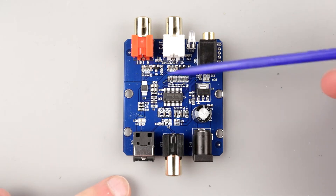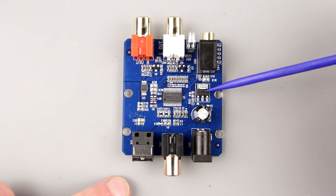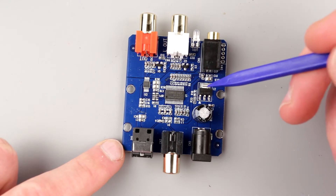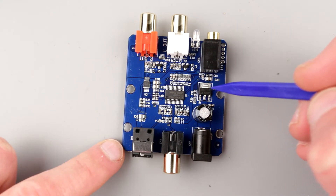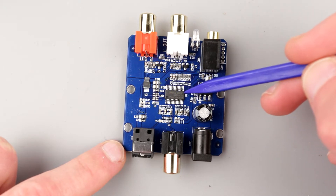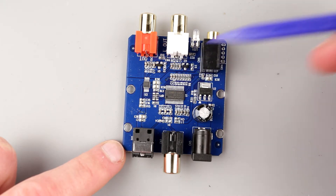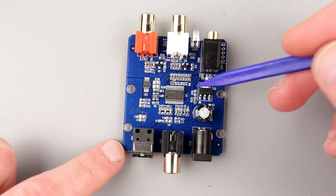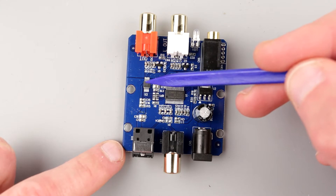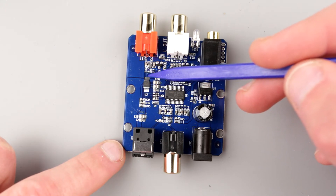Alright. As you can see, there is a minimal amount of parts. One capacitor, one voltage regulator — this can regulate up to 6V, and the voltage used by all the logic chips is 3.3V, so this is a 3.3V fixed regulator. It is the AMS1117. These two main chips — this is Cirrus Logic, clearly indicated. This one is a digital audio receiver, the CS8416, which converts up to 192kHz 24-bit digital signal to I2S. And this little one is a Delta-Sigma DAC, the CS4344, also from Cirrus Logic.